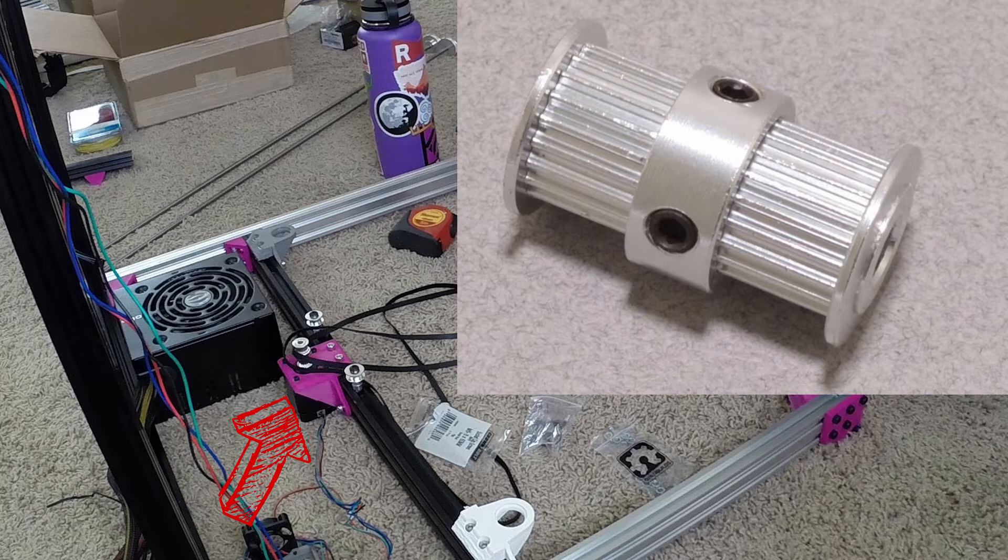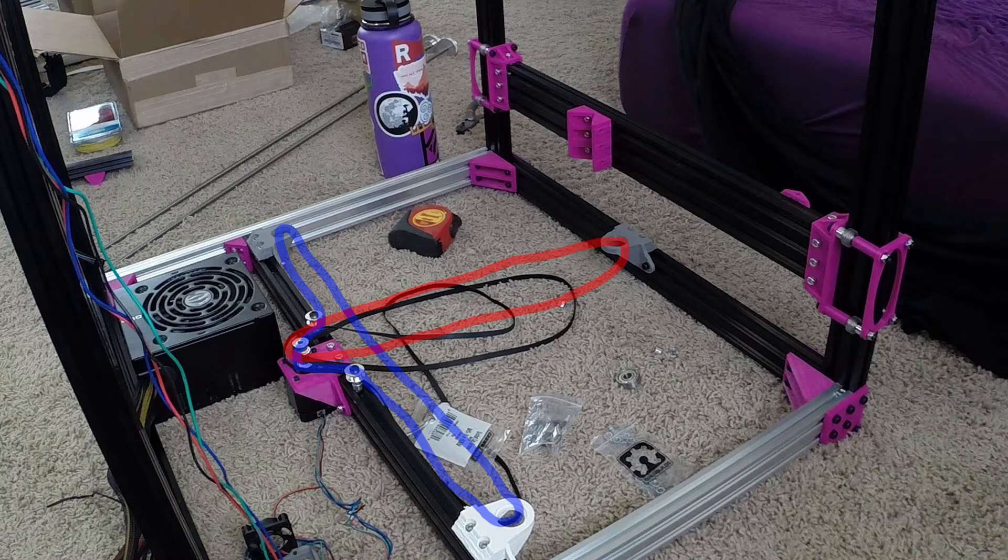This is a 20-tooth pulley with two different pulley sections, and together those two sections synchronize all three lead screws so I don't have to worry about synchronizing two different motors. This is why each set of pulleys on the lead screws must be at a different vertical level. The two main lead screws attached to the Z-bar sit at one belt level, and the third lead screw on the frame has its pulley reversed — sitting a bit higher — so the belt sits at a different height and the two belts don't interfere with each other.